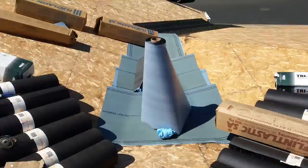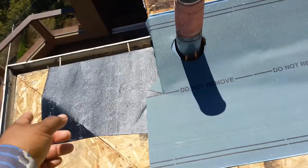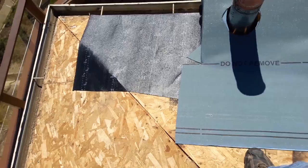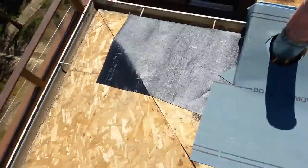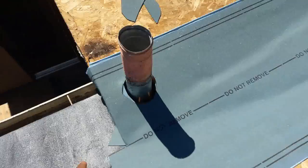I want to show you what I did here before I close this video. All these valleys are going to have peel-and-stick right here. You can see where my mid-ply meets the bottom layer — this is also a peel-and-stick, used for valleys or for the edge of the roof. In some areas the code requires a half-roll or more over the edge metal. It's already marked at 12 inches, 18 inches, 3 feet — whatever you need. So in case it rains, all the water is going to end up on top of the black membrane and it's not going to leak. I did the same on the other side.